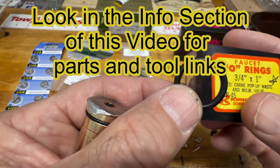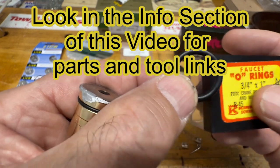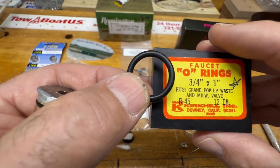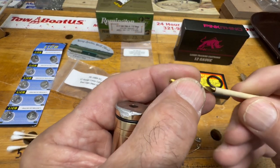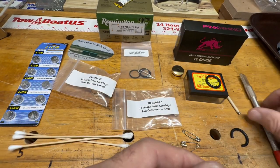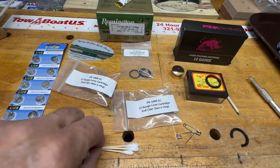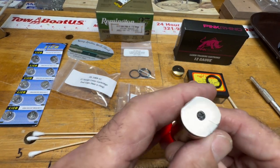You can get these o-rings on Amazon cheap — I'll have links in the description. You'll also need a brand-new one-eighth inch drill bit. Do not use a dull one from your arsenal, because we're doing this by hand. You'll need an exacto knife with a brand-new blade to trim properly, a safety pin, and a couple of q-tips to clean up the rubber, since over time compression produces a little oil.